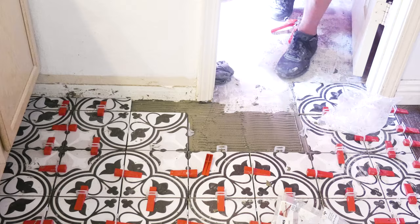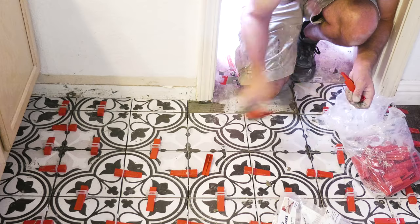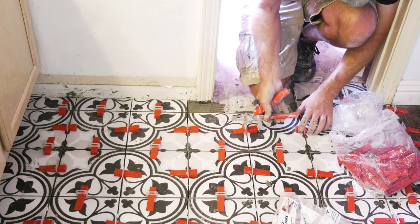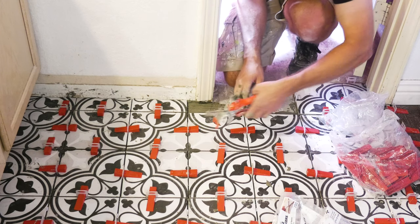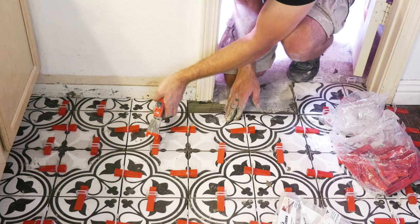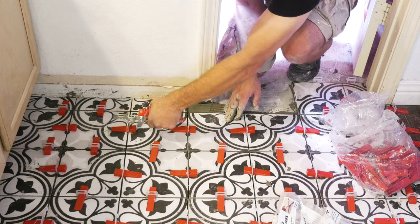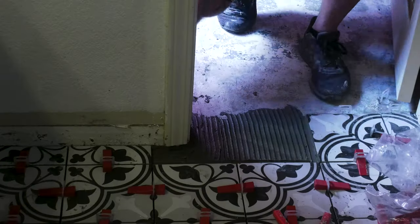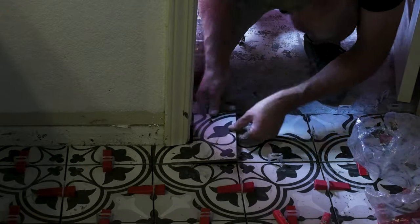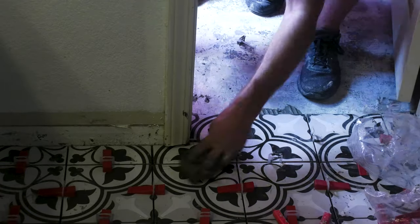It was really fun putting in this floral pattern tile because it was kind of like putting together a jigsaw puzzle — you had to make sure each piece was going where it was supposed to go. There were a couple of times where I wasn't paying attention, just in the zone, and put the tile in the wrong way, so I had to pull it back up, rebutter, re-trowel, and put it back in. But for the most part, once you get the system together, know your floral pattern is on a line, and you're square to a wall — as long as you're paying attention — you'll have a really beautiful floor. This was a bold move and we're really excited about how it turned out.